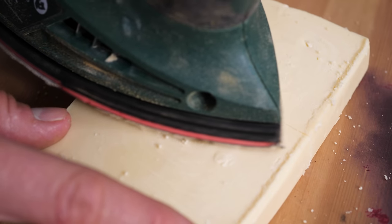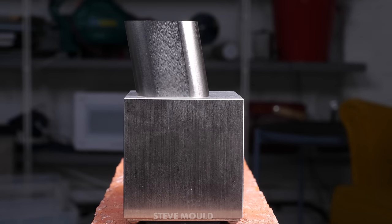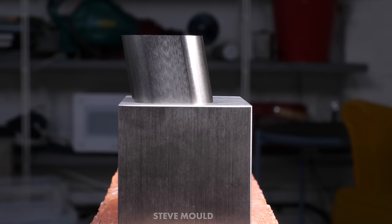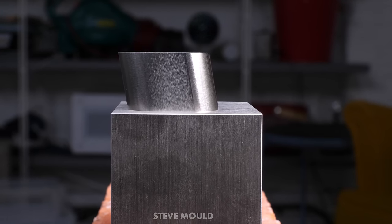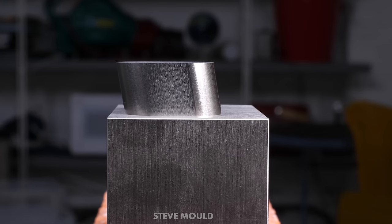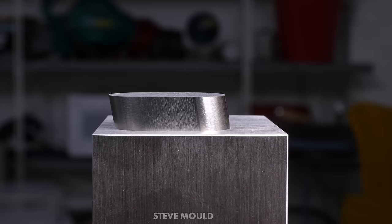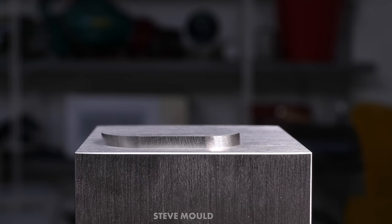And look, you can achieve the same thing with cheese. Even knowing how this is done, the precision is unbelievable. A typical wire EDM machine will have a precision of around five thousandths of a millimeter. Why is wire EDM so precise? It's mainly because the tool and the part never touch, so they don't perturb each other in the same way that you get with an abrading tool.